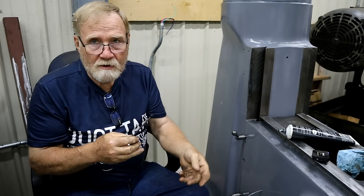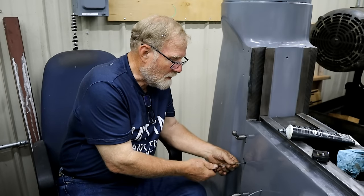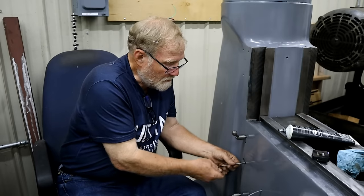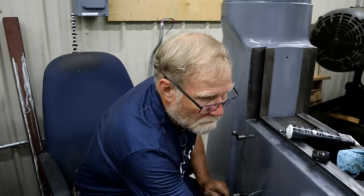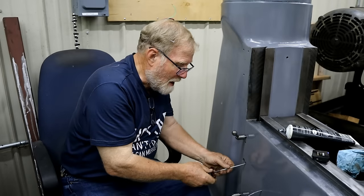And if you're taking one of these things apart, remember, there's a lot of times people put these kind of arrangements on machines to lock things down. So you think you've got one out. There may be another one under there. Okay, that locked that other in place, and when I did it, it made it too tight to turn this. So I need to back off of it.